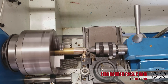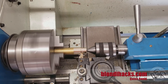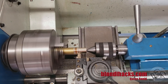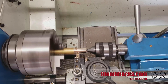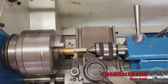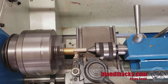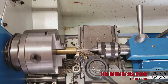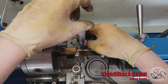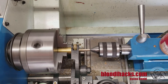Now we're making some chips. This is a 100-thou pass — 50-thou depth of cut on each side — which is probably the upper limit of this machine, but brass is pretty easy to cut and the tool is sharp. Just a little bit of cutting oil there as it's getting warm down close to the end. As we get down to the end I'm going to throw out the clutch and bring it up to the line by hand. On this finishing pass I'm going to stop everything and not move anything, clean off the work and the anvils for an accurate measurement, and check our hopefully final dimension. It came in about seven ten-thousandths over, so I'll take that all day.